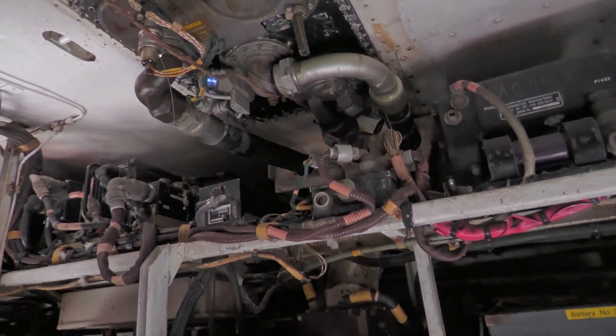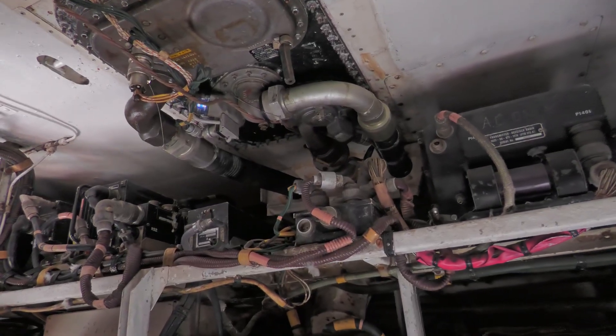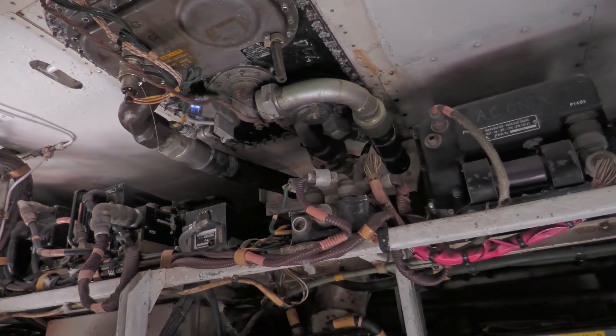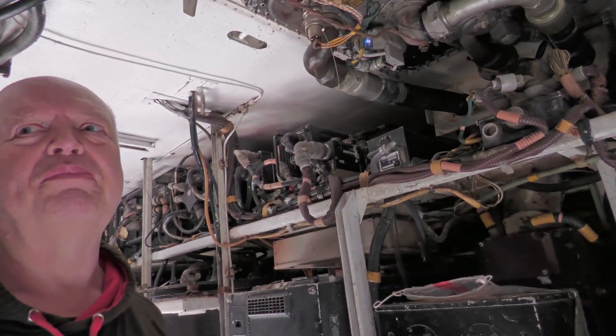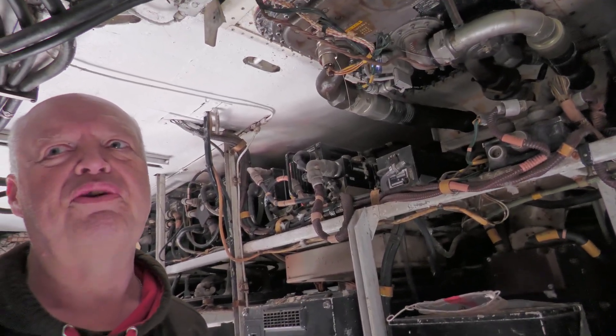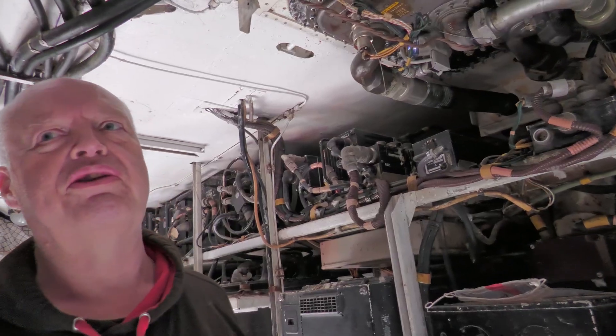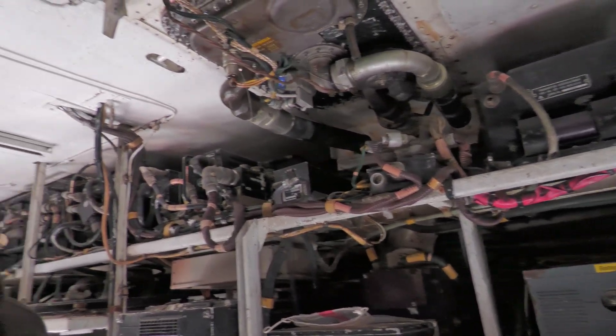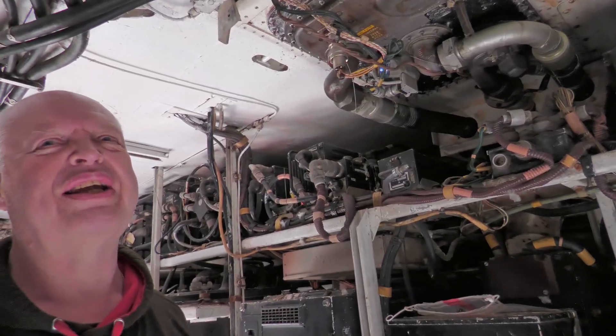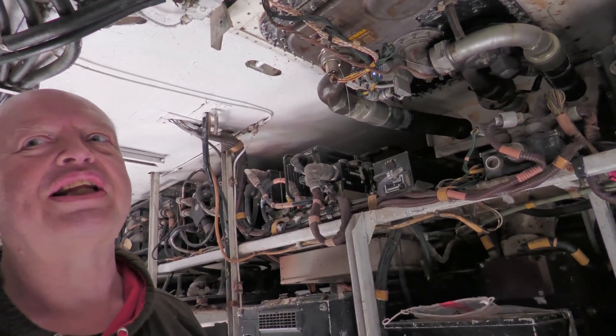Is there a tolerance of an acceptable drip? If we're just seeing a smear of fuel randomly from it, we're happy with it. If we're seeing a constant flow, then we're going to do something about it. But it depends on the weight of fuel, the head of fuel that's above the tank, and because of the age, they're going to leak a little bit more.